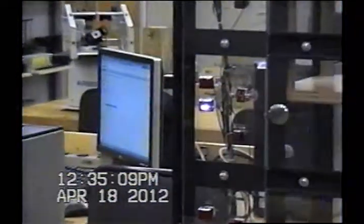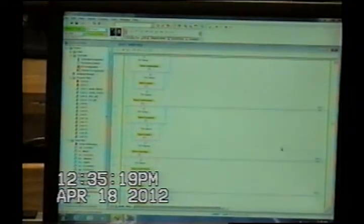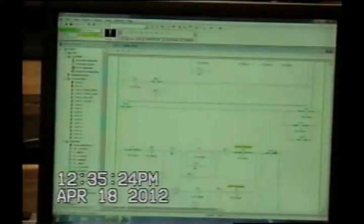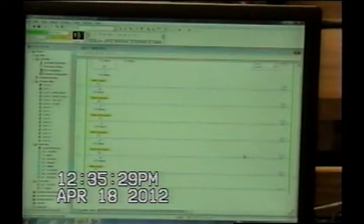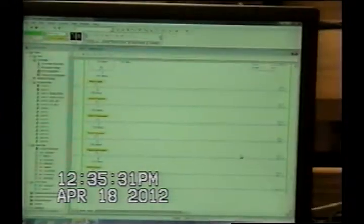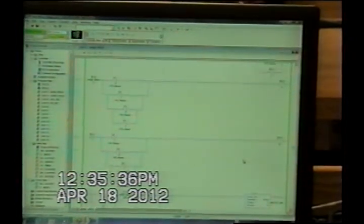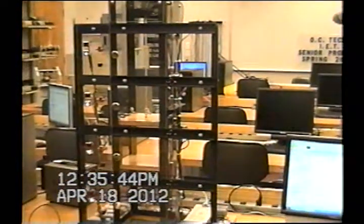And while we're waiting on it to go to one, this is our program. We had to use counters and timers, and we used drum bits to lock everything out. There's our up rung where I put zero and our down rung where I put one. We got our 7-segment LEDs right here. We use these sensors to fire and make the two come on, these to make the three come on, that one for four, and the bottom one for one.